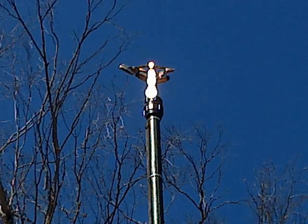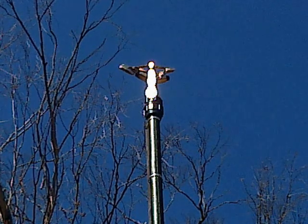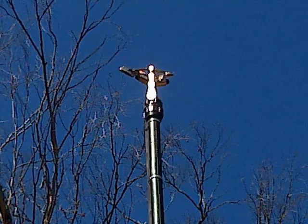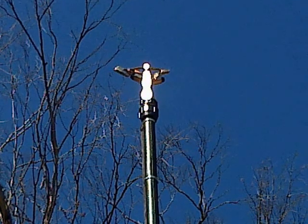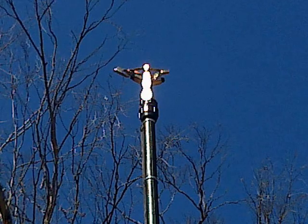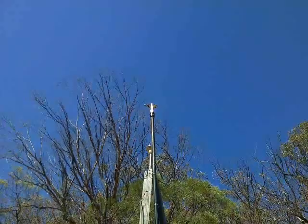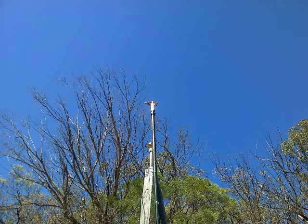And all of these calculations rely on the base of the sprinkler being rigidly mounted. And despite having a meter and a half of aluminium extruded channel fixed to it, it can rapidly get itself into a harmonic situation where it's doing that. And when it's doing that, the energy required to wobble the setup comes out of the system that's designed to rotate the sprinkler. So instead of going around once a minute, it might take 5 minutes to get around the circle once, which is kind of irritating to observe. It's not the way it's supposed to work.